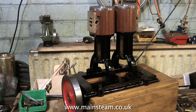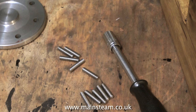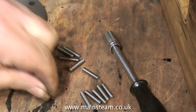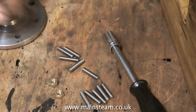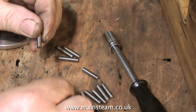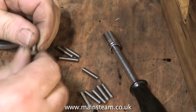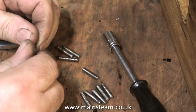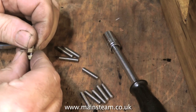It's time now to look at the fixings. These are some 2BA studs that I made, which are going to hold the cylinders onto the upright standards. If you've been watching this video series from the beginning, you will remember that the cylinders were held onto the upright standards by some simple slotted bolts, one of which was damaged. So I'm going to use studs — it's a much better idea. The studs will locate securely in the standard, and then I can just put nuts on from underneath — far easier.